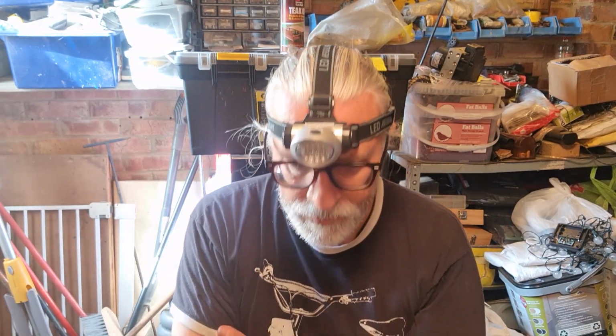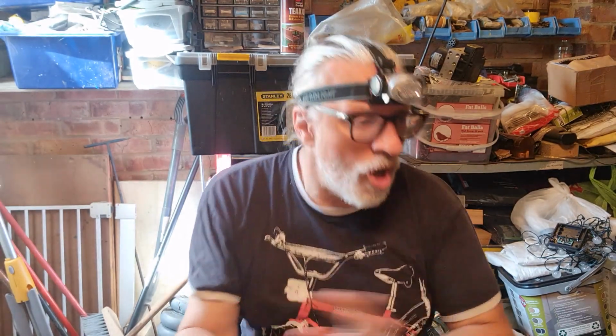Now, if you are somebody that has a water appliance and does not have an isolating valve on its supply, then you are a nonce of the highest order, a Class A nonce, because it means you have to turn the water off to the rest of the house. So if you've got an isolating valve, you just turn it off and then you can work on that appliance. Nobody else is interrupted. So, little lesson: always have an isolating valve on every appliance you have.